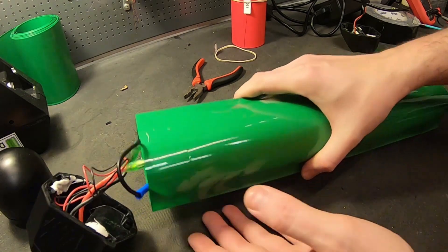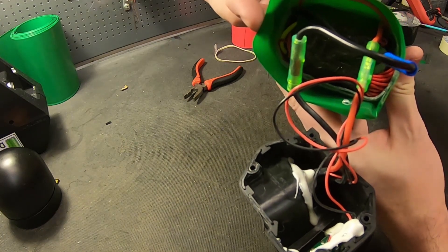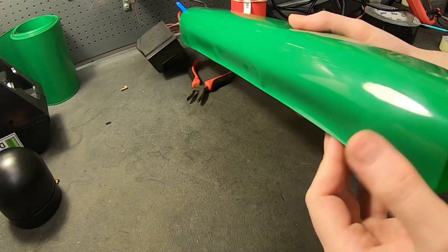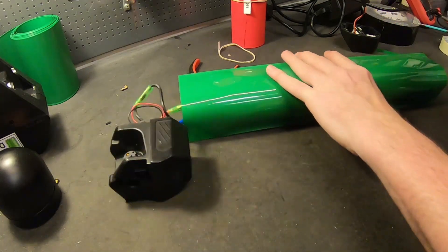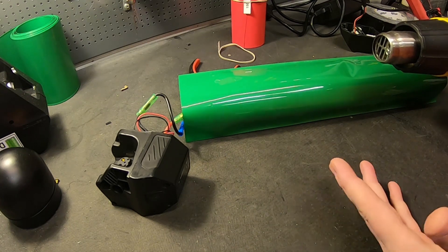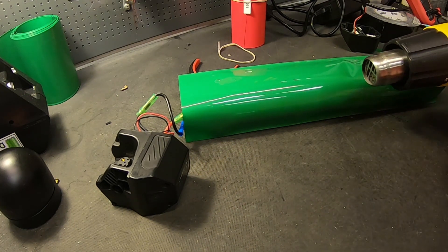That's a perfect fit. There is a tiny bit of margin — I'm using about two to three centimeters extra on both sides to make sure it covers the battery on both sides. When it comes to heat shrink tubing, you can actually use a hair dryer — that's an excellent tool — but it's not adjustable in temperature, so if you do it a lot you should use some kind of hot air gun.